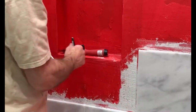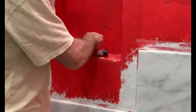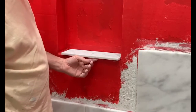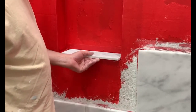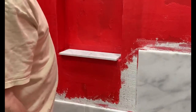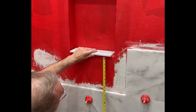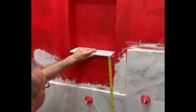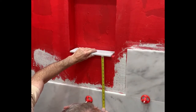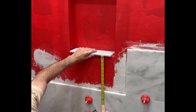I'm going to do the same thing taking the other measurements — the same on the other side and on the bottom. I'll measure from here to here, subtract the grout line, add the thinset, and do it on all three sides. Then we'll tile this whole wall and come back to finish the niche. When it's angled for the water to run, instead of nine and three-quarters, it's going to be one-sixteenth less — about nine and eleven-sixteenths.